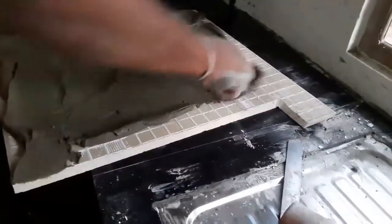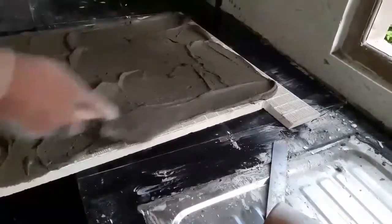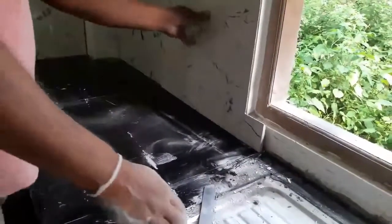You can also use a small thin trowel to remove small amounts of thin set at the edges of your tile as you go. Don't allow the thin set to skim over or start drying as you go. If it does, remove it and apply new thin set.